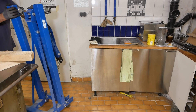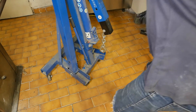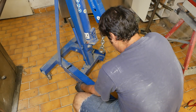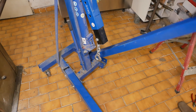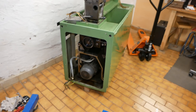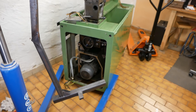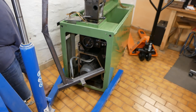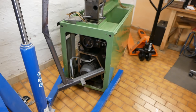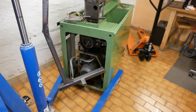This crane belongs to our channel's number one fan, Nico. This kind of car motor crane is really not that useful for moving machinery — it's supposed to go between the wheels of a car so it's quite narrow, whereas with a machine you really want it wider. Quite a few people on the internet have chopped the frame down and widened it if they use it for moving machines. Because in this case I'm only lifting a couple of hundred kilos, I can extend the boom.